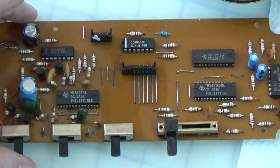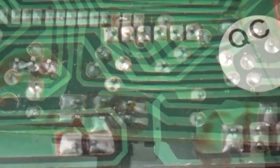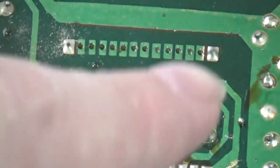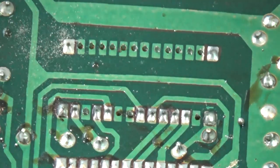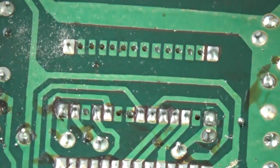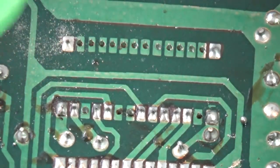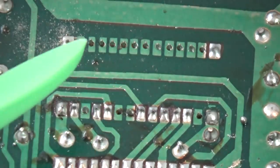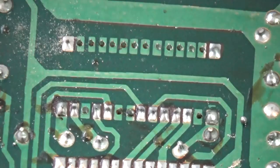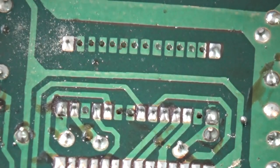When I looked at the bottom of the board, I was first taken by just how filthy it is — it's coated in a layer of flux. Very common on this kind of single-sided board. This is the back of the chip for the ROM, for the speech processor. They only soldered the pads that they used. The two on the top are just there to hold the two corners of the chip down, but there are no openings in the solder mask — the pins are just sticking through. Could it be possible that this was built down to such a cost that they determined the cost of solder and flux on those pads, if they could save them, they'd get a ten-thousandth of a penny off each board? I've never seen that in a production board, ever.